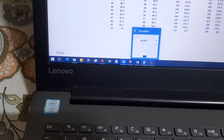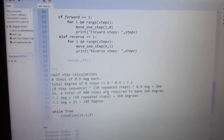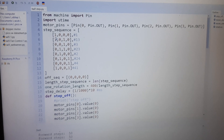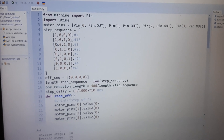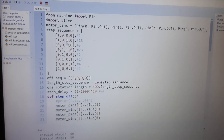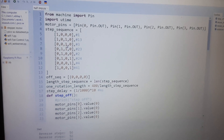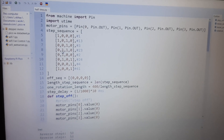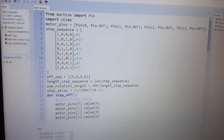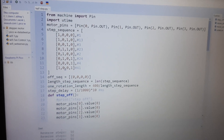This is the MicroPython code I've used. This is the motor sequence: first, the first coil will be on; then the first and second pair together; then only the second pair; then the reverse of the first pair combined with the second — similarly, one pole at a time opening and closing.